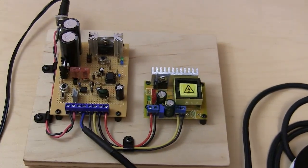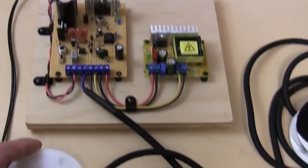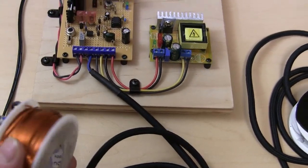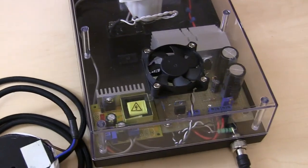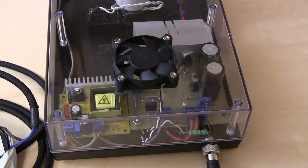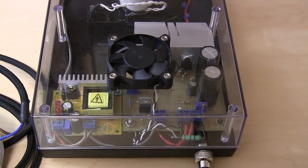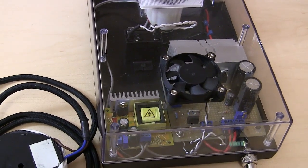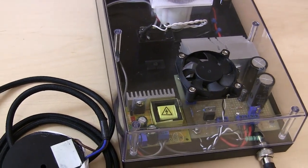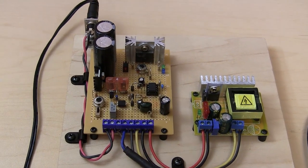And I'm also going to have the circuit diagram for this new circuit. I wanted to address some issues that the old one had. Basically the old circuit is really good but it draws a lot of power — it's a somewhat crude circuit so it wastes a lot of power. And also if you don't supply it with enough voltage from the power supply it won't trigger. So I wanted to make something a little more sophisticated, and that's this circuit here.